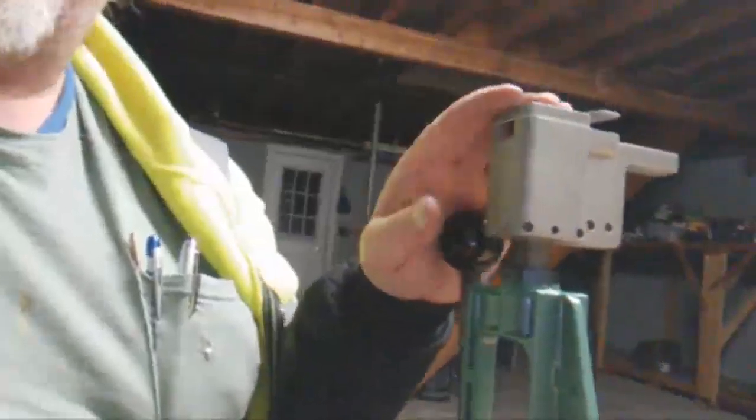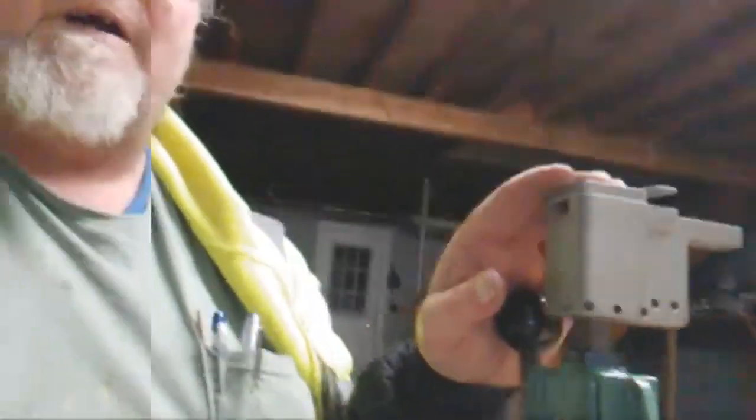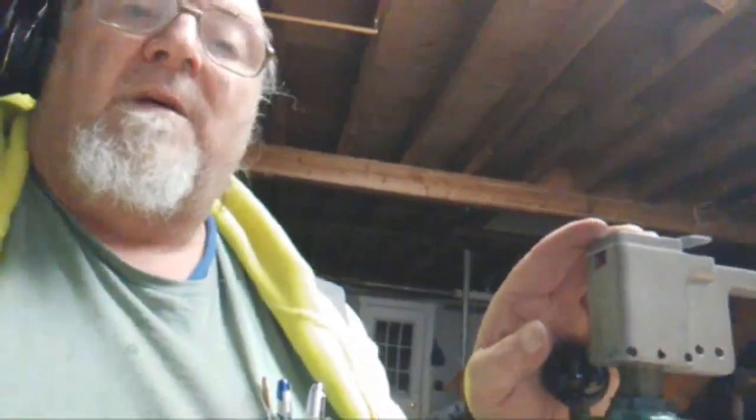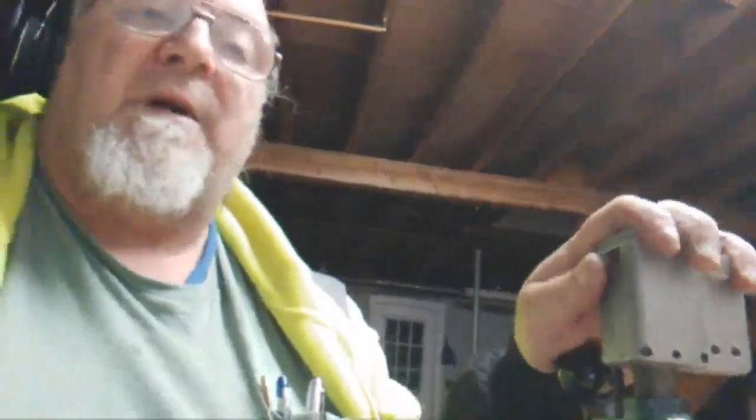And also if I have to pull a bullet or two because of something I screwed up on, I'll pull the bullets that way. I don't have to use a kinetic puller, which I do have. I always find that they make a mess. That bullet releases and it goes down into the bottom of that thing and bounces. When it does, it throws that powder all over the place. So I went to the collet type, RCBS. All I got to do is screw this unit out of here and put that collet system right into this press, and I can use it to pull a little further down the bench here.